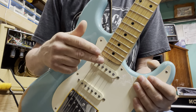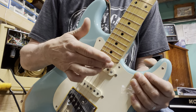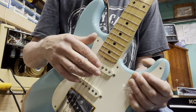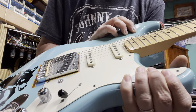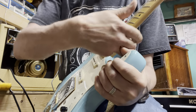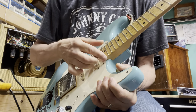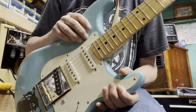So if you do this, what you want to do is take off on these corners here, and you're going to have to profile the bottom a little bit too. I started with a rasp or wood file, got it roughly into shape, and then used sandpaper to finish it. Now it's definitely doable. What you want to stay away from is the body — don't touch the body at all, and don't touch the bottom of the neck. You're just going to have problems if you get into that. All you want to do is work on these corners and across the bottom, and you'll have to take off some wood across the bottom to get the profile to fit.